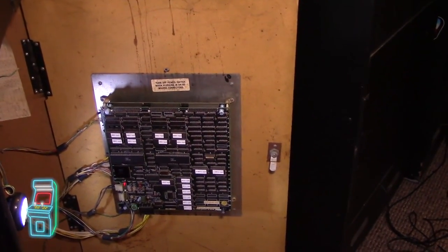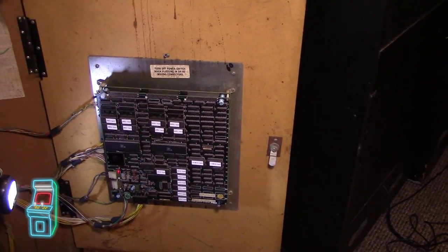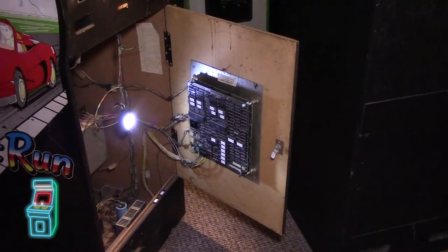I'm going to swap out the Yamaha FM synthesis chip data next and see what happens. I ran out of 256 chips — I ordered more on eBay for the other boards — but there's a trick where you double up the ROM. If you're impatient, I actually showed how to program it and double up bin chips in my Multi-Versus video. There's a tutorial there using the same concept. I'll also have a future video on it along with the enhanced OutRun edition.